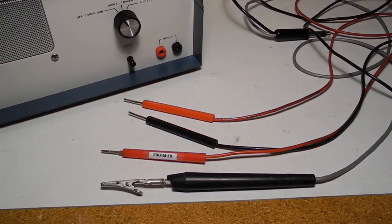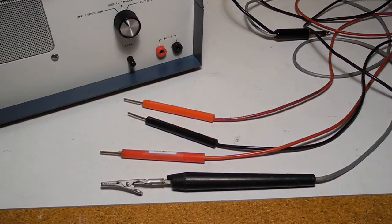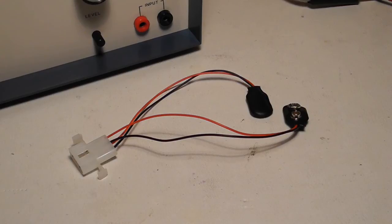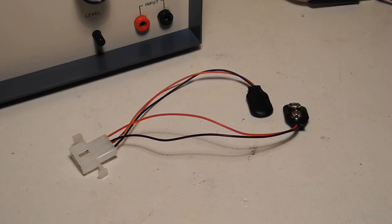The unit did not come with test leads. The probe I showed earlier was actually from a Heathkit VTVM and looks the same. I found some spare test leads with banana jacks that will work for audio tracing. For RF tracing, I made a probe with an internal diode and capacitor like the original one — while it really should be shielded, it works okay. For this and one of my other instruments in the 5280 series that did not have the external power supply connector, I made an adapter cable which connects the 9-volt battery clips to a connector that mates with the power supply so it can run on external power.